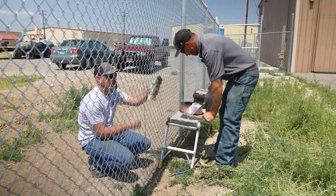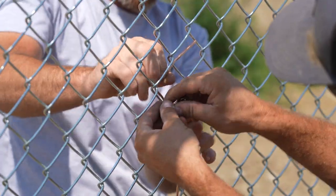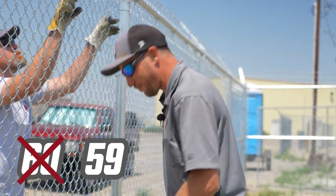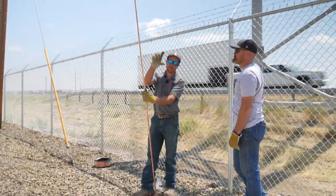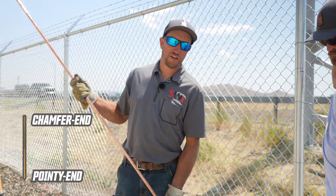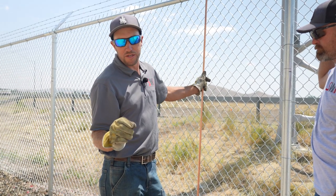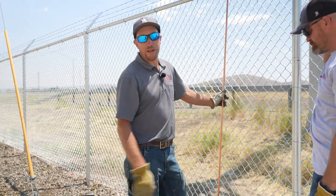And then on that, we also have a clamp — whatever it's called, because I'm not an electrician. I think on this one we've got to do this about 60 more times. 59, because we got one done. It pays to do it fast and efficiently. One thing I didn't tell you — this ground rod is 5/8 by 8 foot, and they want all of it in the ground, except about that much. When driving it, one end is pointy and the other end has a little chamfer on the top. You want the pointy side down so you're guaranteed to penetrate. Just so you know, we do have locates — we did call them in. You don't see any paint on the ground because we're clear; there are no utilities right here.